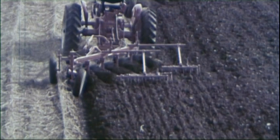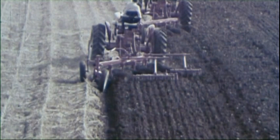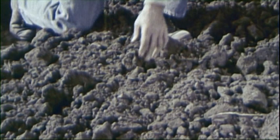In addition to the one obvious advantage plow mulchers offer, reduction of seedbed preparation time, there are other advantages. When this plow mulcher breaks up the clods, it doesn't leave fine powdery soil that will crust over with the first rain only to let moisture run off. Instead, it leaves the soil nice and loose so that moisture can penetrate.